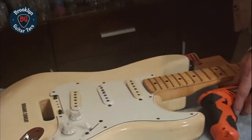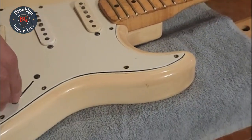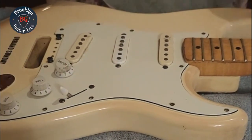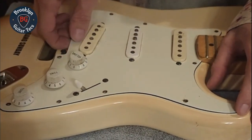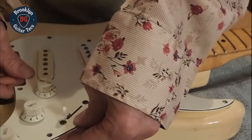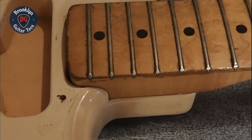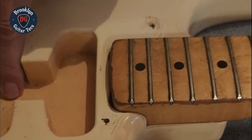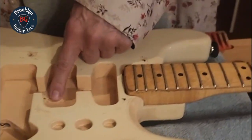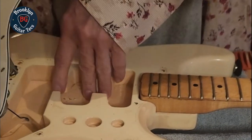All right, so here comes the big reveal. This is also way too loose and crooked, which makes me think it's maybe not Fender original, but here we go. Did I miss any screws? No. So this just pops out like this. Okay, so it's nice and clean on the inside, but it's not shielded. Shielding is that metal stuff, or you can get shielding by paint. It has nothing. It doesn't have a painted shield, which is something I'm going to do for him. I'll shield this, because if you don't shield it, you just get a lot of noise.